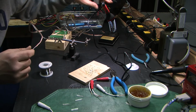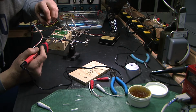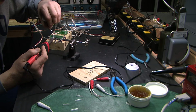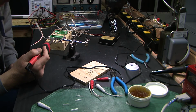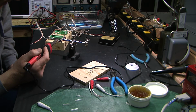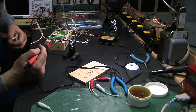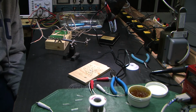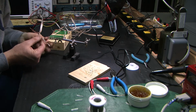And electrolytics, I've heard they don't have a long lifespan compared to other components. I've heard people say 20 years, 15 years, some people say 10 years, but they don't, the electrolyte, I guess that's what you call it. There's a fluid inside, and the electrolytic capacitors will leak, or the fluid will dry up, in which case the plates could arc, and create a series resistance, or just a flat out short circuit, which is that'll blow a fuse immediately if there is one.